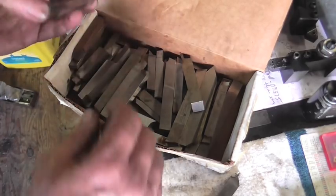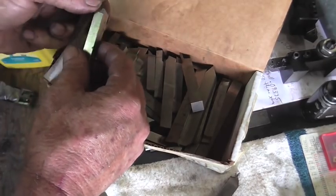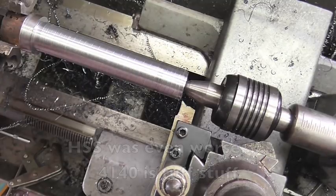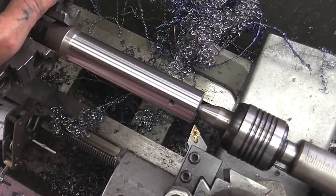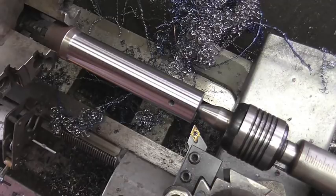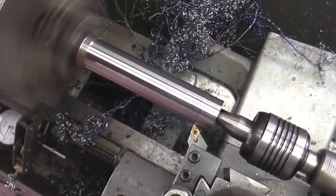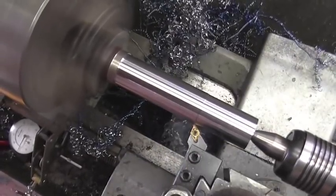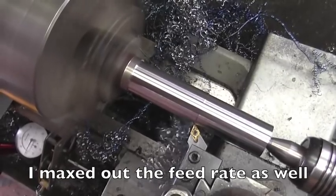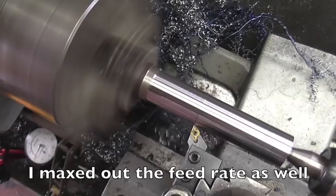This is a box of high speed steel that I got from a friend of mine. Desperate times call for desperate measures. I always run the lathe at 685 RPM, but this lathe will go faster — so for the first time ever, I'm turning metal at double that, at 1270 RPM. Getting some fireworks down there by the carbide tip.